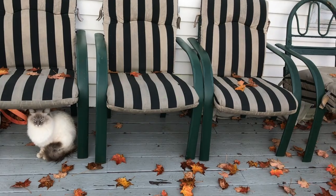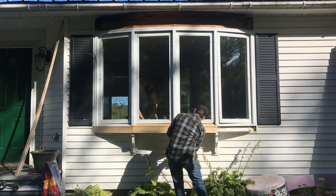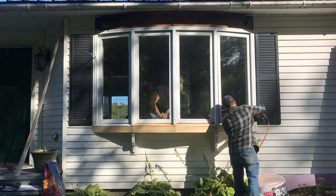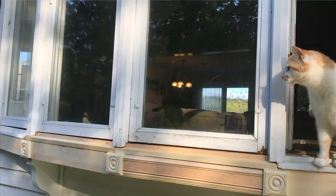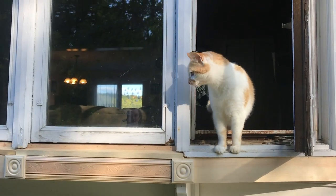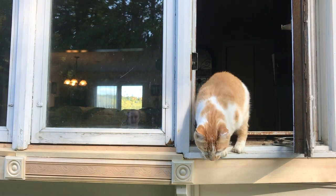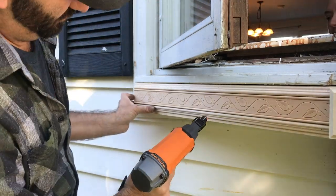And there's Yeti. After that I cut some pieces of wood for sills and got those in — wasn't very good about filming any of that either. And then put the trim back on. Got all the trim on, cut the fancy trim as well. I had to work some angles on the miter saw to make that work, because the bay window was cut at like seven or eight degree angles.